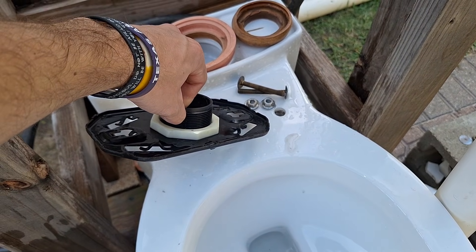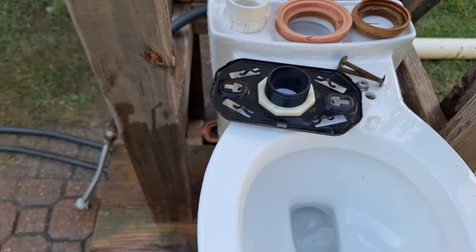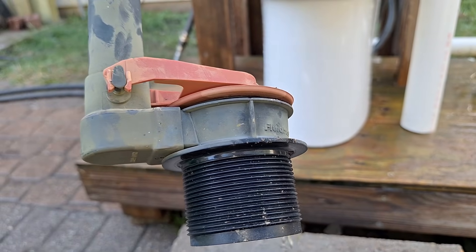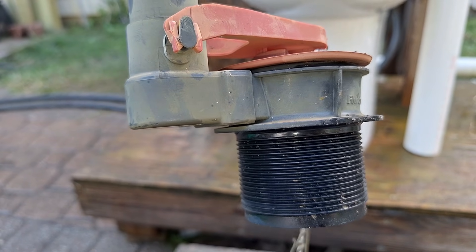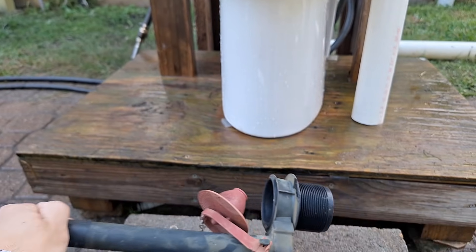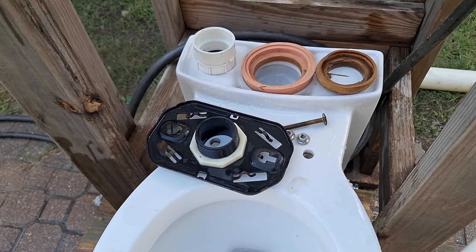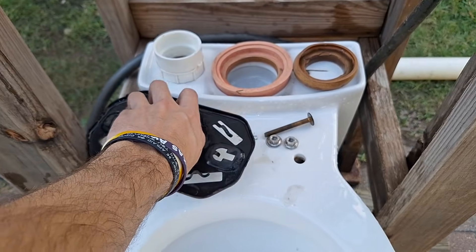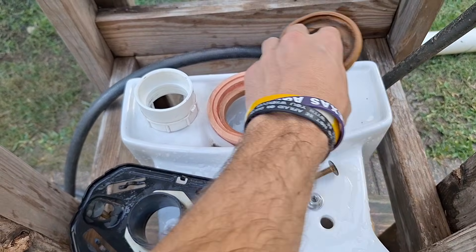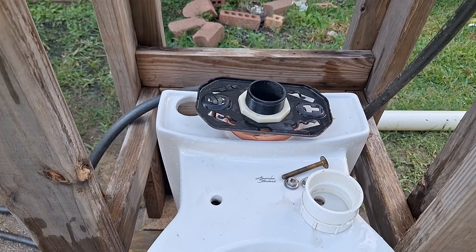This little piece here is the bottom of a flush valve — I used a hacksaw and cut the flush valve down to just the threaded part. You want to use a Fluidmaster flush valve because that little bottom piece does not connect to the tube, so you can stick a hacksaw right between the tube and that bottom part and cut it off. I use regular tank bolts, put a seal on here so it can hold a gasket better, then place it on the toilet. If you want to test one with a three-inch flush valve, just put this gasket on top of the three-inch gasket and place this piece on top.